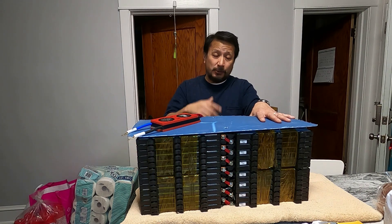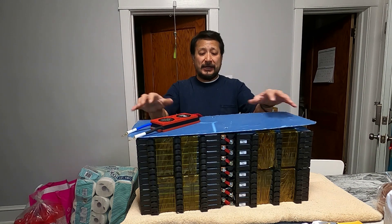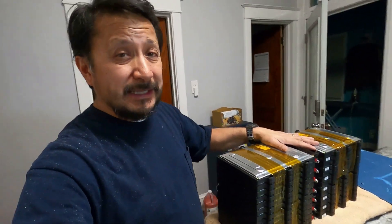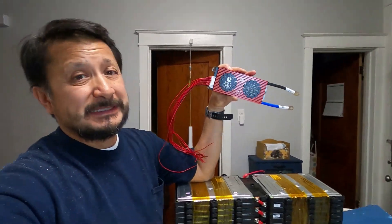This is a warning about lithium-ion batteries. These are actually called LG Chem pouches — lithium-ion chem pouches. They can be pretty stable if you treat them right, but you cannot charge lithium-ion batteries without a battery management system. If you get raw cells, do not try to charge them unless you have a BMS, and do not skimp on your battery management system.